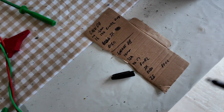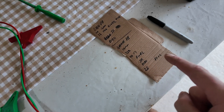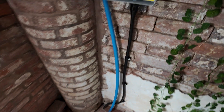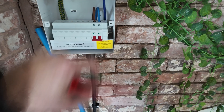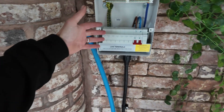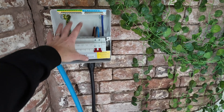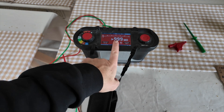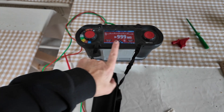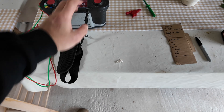This is obviously going down to the customer — the issued test certificate. So insulation resistance test: I need to go to the other end of the board and disconnect the other end. Take the link out between the live and the earth so we can carry out our insulation resistance test. With the other end disconnected — out of the RCBO and out of the MET, so you won't get any parallel paths — you hit your test button and you should ideally get 999 megaohms. If you get a slightly lower reading, the chances are it's because of moisture and things like that. But that's what we're expecting — 999. So we now know that we're safe to energise the circuit and do the RCBO test.